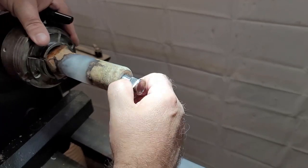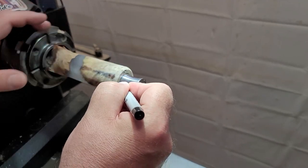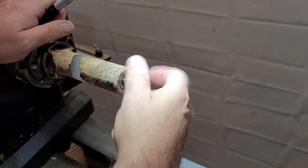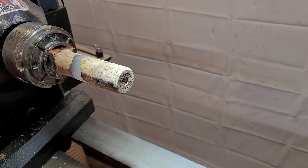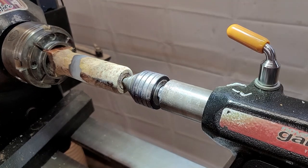The Stainless Steel Bottle Stoppers mandrel has a built-in bushing — you'll see that here in a second. But I like to do a little bevel on the end of my handles, something for your thumb to rest against. I'll put that hardware in and mark it as a guide so I know how deep I can turn.